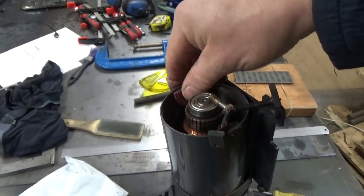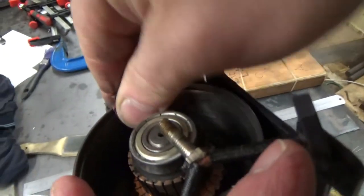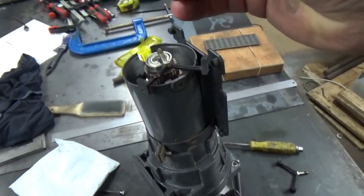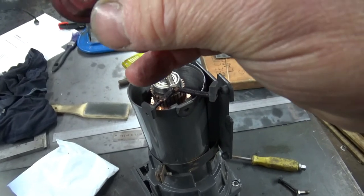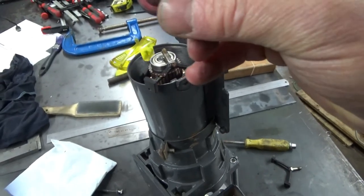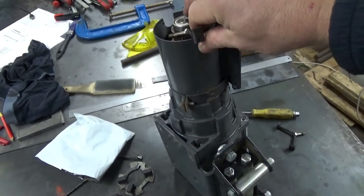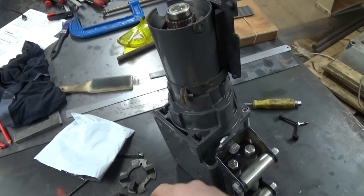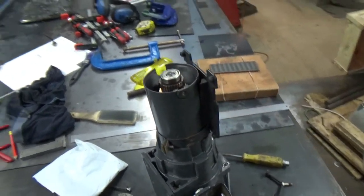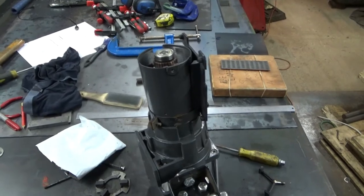So the side which had the damage, the insulator is slightly, it's going to come to pieces. Nothing is going easy on this, it wants to pull itself to pieces constantly. But the insulator is slightly damaged, as can be seen there. Again, I am not worried about that. Either it was damaged by the person who took it to pieces in the first place, or it was damaged because of overheating when the brushes were touching. So I'll have to go. Can't do it one-handed. It ain't happening one-handed. Anyway,